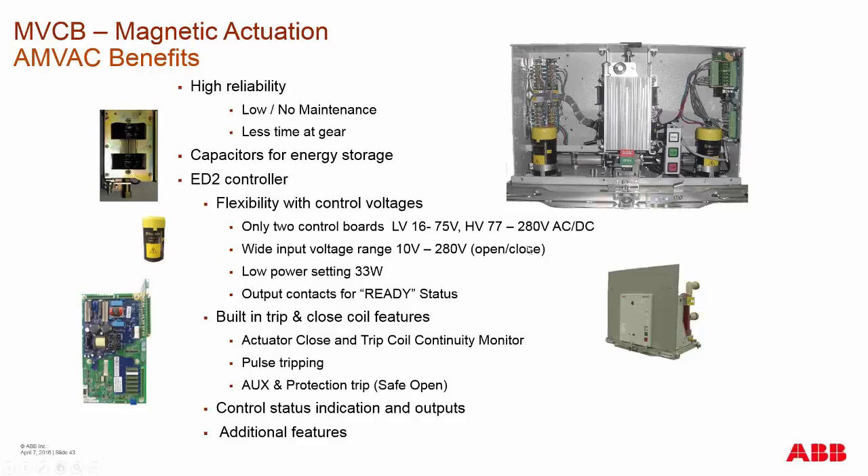We quote the range that it takes to charge the standard seven seconds that it's supposed to. If you have 40 volts going into a high voltage board, it might take 20 to 30 seconds to charge rather than the standard seven seconds at the rated input voltage range. The input voltages are used to do your close and open operations.